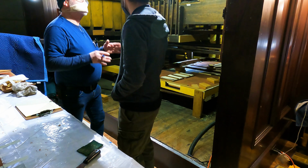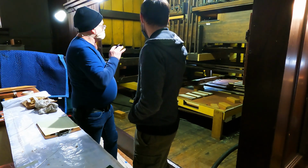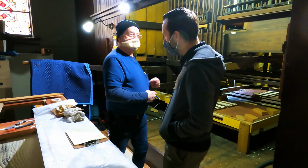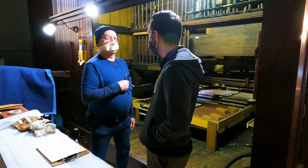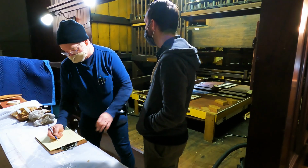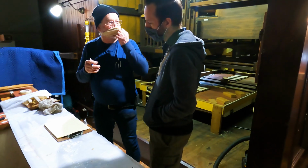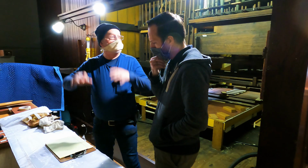We're changing the width of the ribs at the top, so it will line up in the normal place on the top. And when we put it back in, the bottom rib will line up at the normal place on the base. And so why wouldn't you trim both of them? Because that will move everything. We only need to move one. Okay. And that doesn't throw off the mechanics of the whole thing? Oh, no. That makes it fold easily and not bind when it's closed. When it's open, it'll work either way.